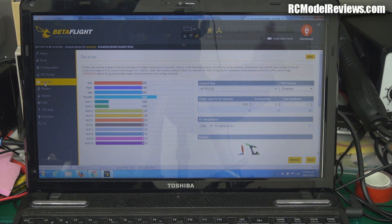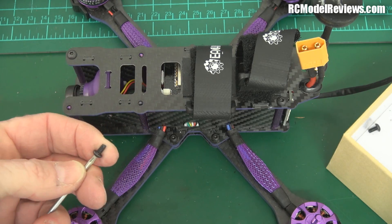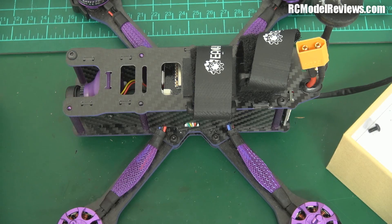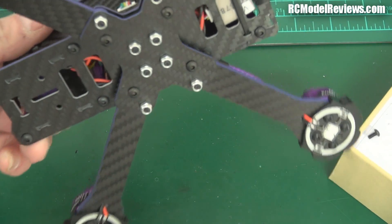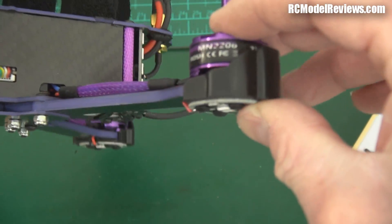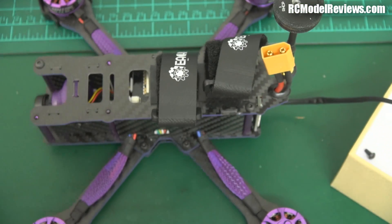Fortunately only the inverter was stuffed. Right, so I'm putting the lid back on it, we're putting it back together. One thing I noticed, which a lot of other people have commented on too, is that there is not a drop of Loctite in this entire model. Look — there's the screws that have come out of the top. No Loctite on there, this has never had Loctite on it. Others have reported that the motors fall off because the screws that hold them on — these are soft mounted — have no Loctite. So I think the first thing you're going to have to do if you buy one of these is strip it down and put Loctite on all the screws, because otherwise it'll probably fly apart in the air.